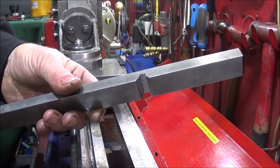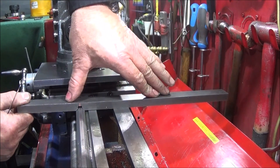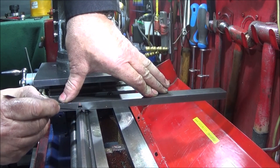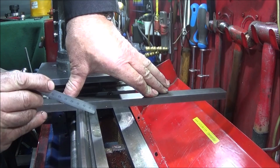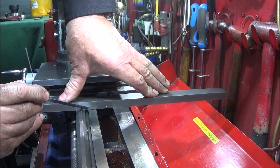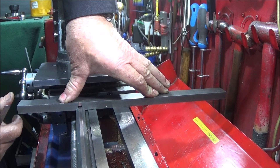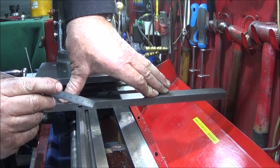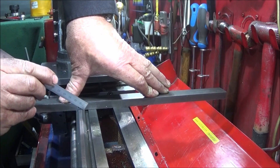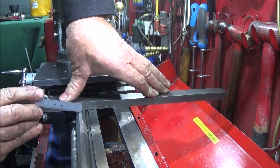That's what it looks like when it's milled out. When I put it on the ways and push it down, I can see there's a bit of a gap at the back on this one. So I can actually put some feeler gauges under that one and see how much more of the angle I need to take off. When it's dead right it'll be flat on the ways and touching these two angles, and there will be clearance here for the top.